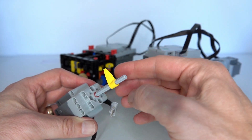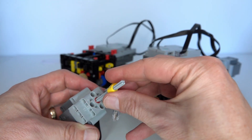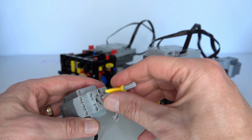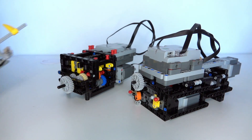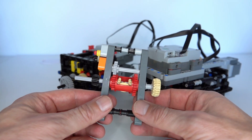You can ask the hub: what is the angle of this motor? It might be 0 degrees, 90, or any other particular position. You can also measure the speed of rotation of the motor. I thought this is great - I can use this new functionality in my automatic gearboxes, because one of the issues in the gearbox is you have to somehow measure the torque at the output in order to make a gear-changing decision.